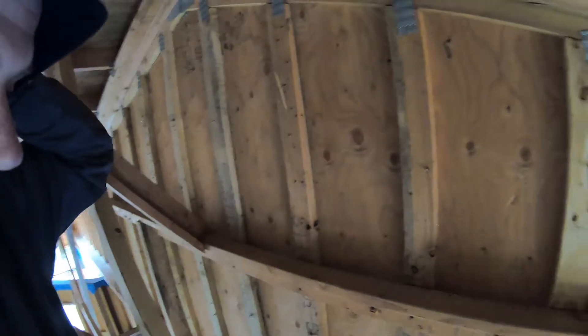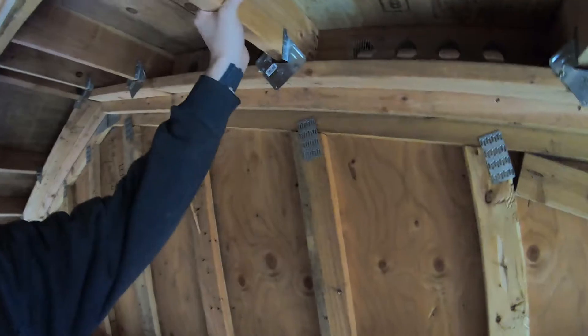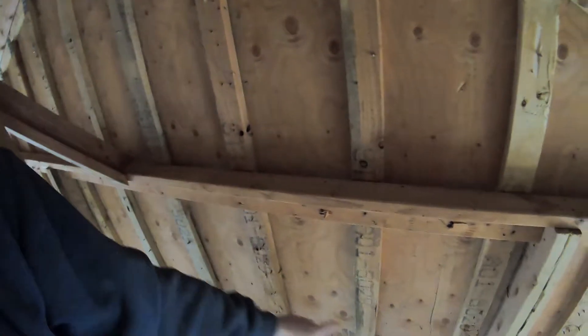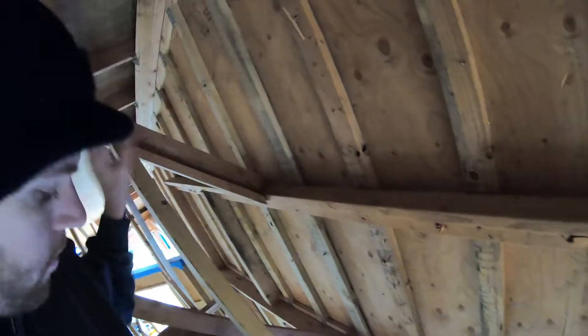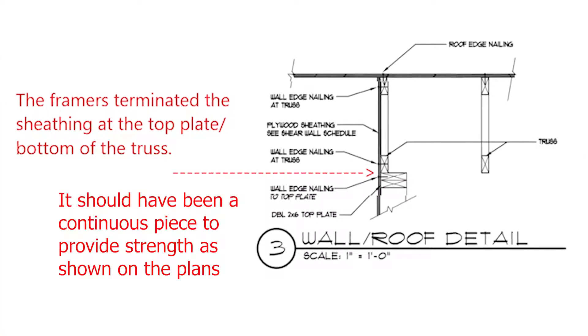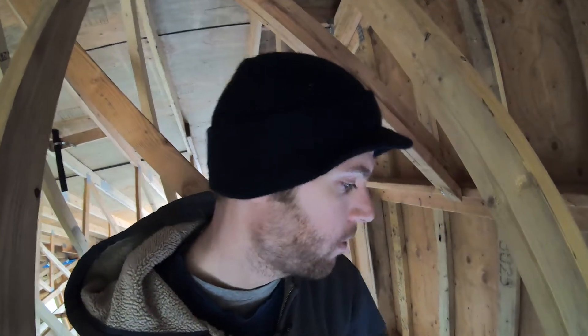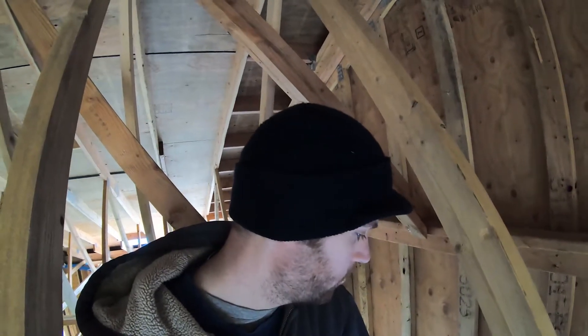The other thing I wanted to point out on this gable end: not only was this connection not good enough for the forces it might experience, but the way the bottom of this gable was connected to the top plate was not good enough either. On the plans it showed plywood extending up past the double top plates of the wall and connecting into the bottom cord of the truss — but that was not done. They ran their sheets straight up to the top of the wall, then set this thing — they had sheeted it on the ground — and just set it straight on there and toenailed it into the double top plates.